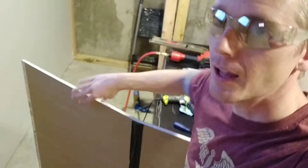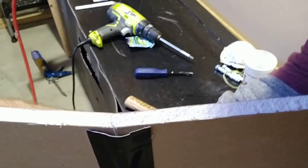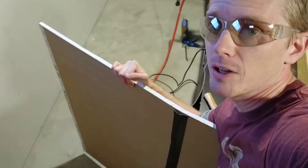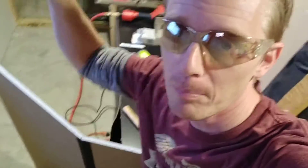Just slice the back, snap it, and add a piece of tape. If you look at that tape, it kind of acts as a hinge — put it on loosely and it acts as a hinge so you can get your drywall around a corner. And if you really need to bend it, you can keep the tape off, bend it, and then flatten it back out.